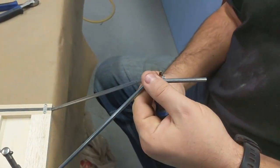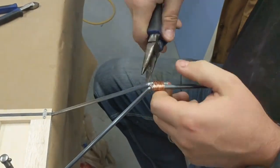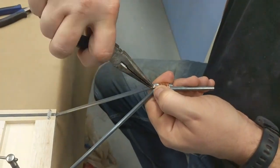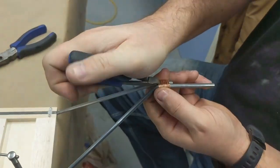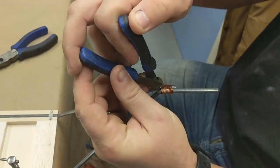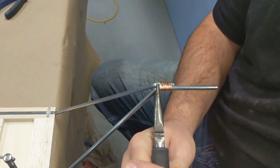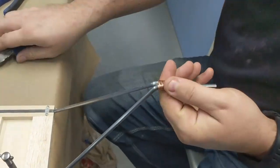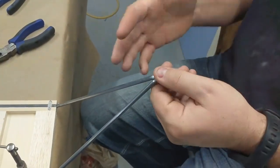Once you get that, I like to take the pliers and bend that over tight so that it's tight against it. I'll squeeze it and re-bend that in there. I've got my little end here — we can cut that off. If it stays tucked in, it's fine; if it comes out, you can just snip it with the side cutters. Use your pliers to make sure it's nice and flat against there. Now I've got that wrapped nice and good. The reason you want to make it look neat is because you are going to see some of the wire through the solder joint.